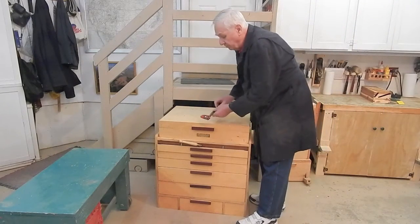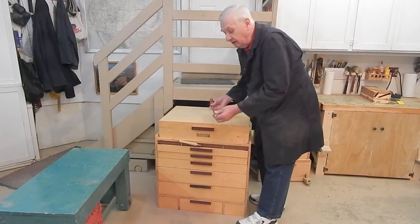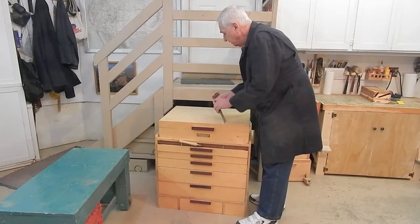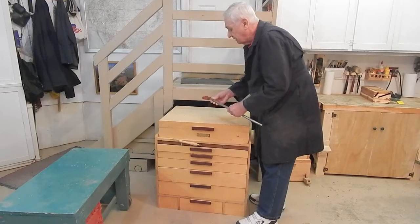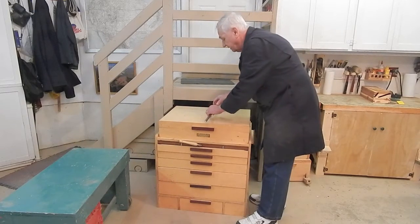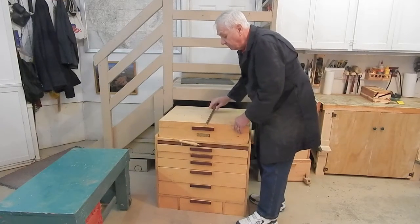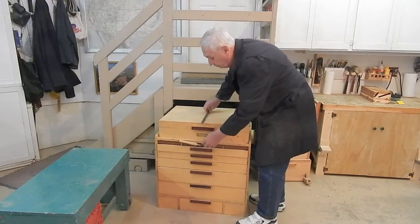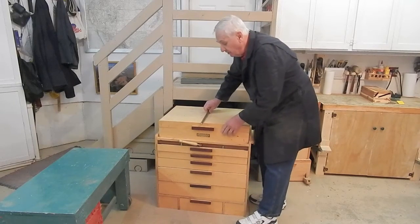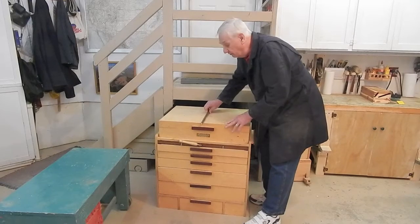While building it, I'm going to improve upon the design of the rod shaft. Instead of using this steel tube, 5/8 outside diameter, and rather an awkward arm construction at the back end, I'm going to use a 1/2-inch steel rod, which I think will be much more readily available, and that'll also require only up to a half inch diameter drill bit, which I think most of you will have.